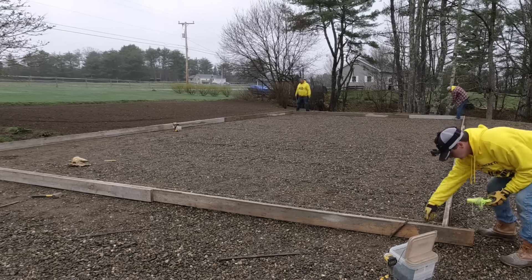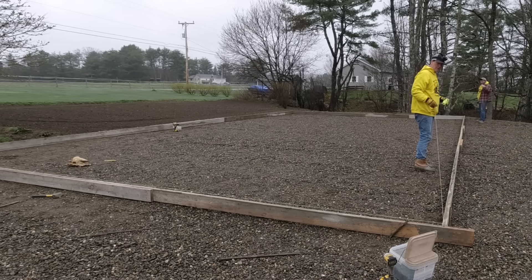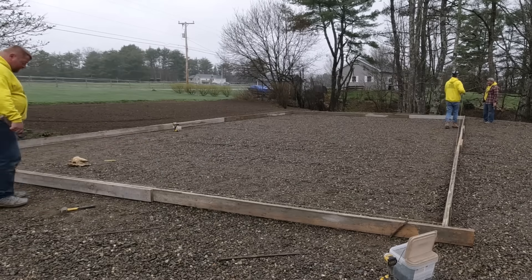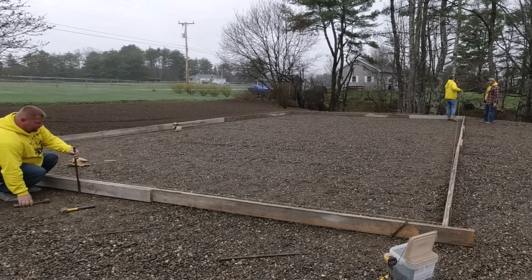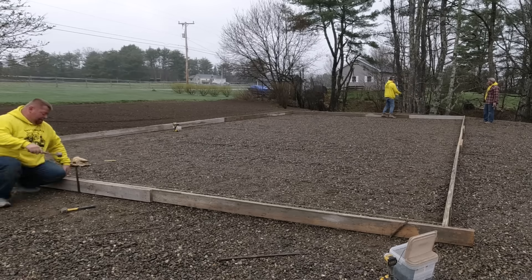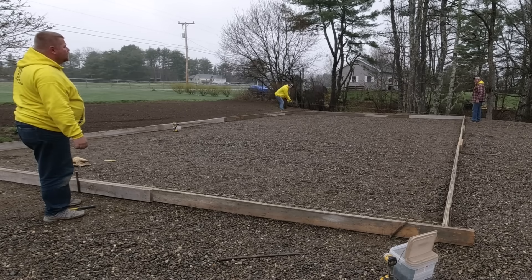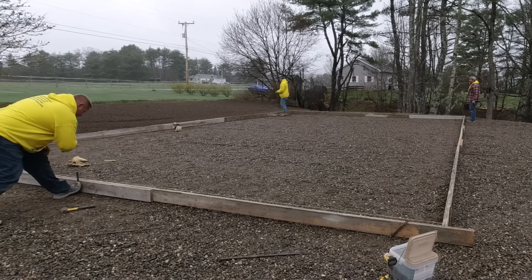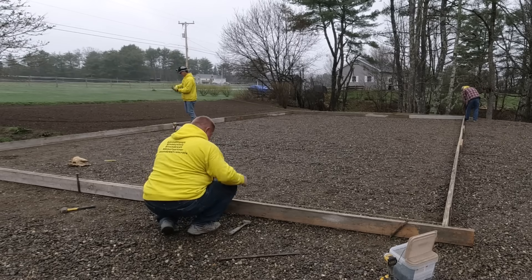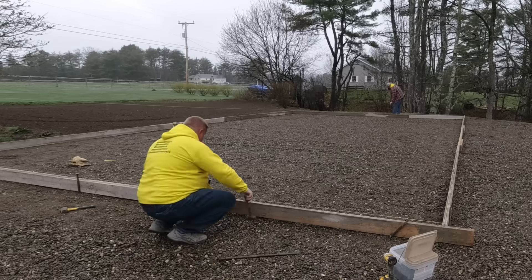Sometimes the homeowner or contractor will have actual pins in the ground for the two front corners, and then we square it to those. This guy just said, fit it on that gravel pad the best you think and I'll live with it. You can see how hard those pins are going — those are metal pins using a 3-pound sledge and they're going in pretty hard. This gravel was packed really, really good. Now I'm running the string around, and we like putting the string right in the middle of the form — that's just the way we've done it. We'll eyeball that string right in the middle as we're pounding the stakes in. A lot of times we'll even pound the boards in just a little bit from being perfectly straight, because when the concrete gets up against the board it's going to put pressure outward.